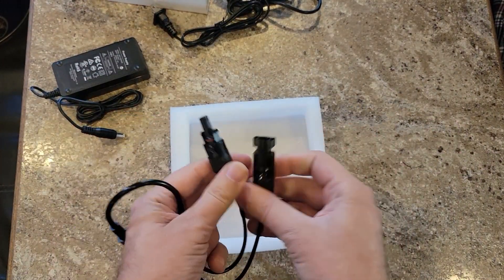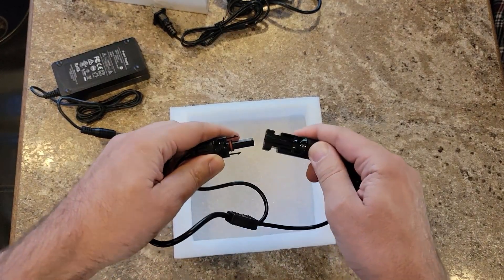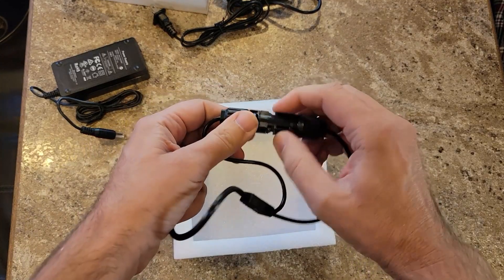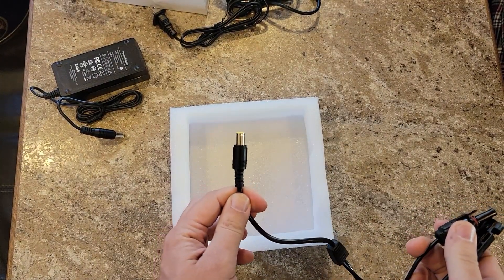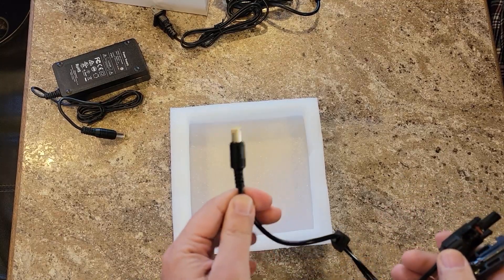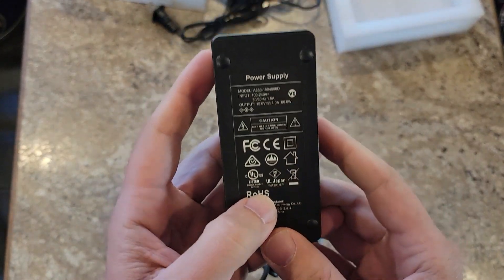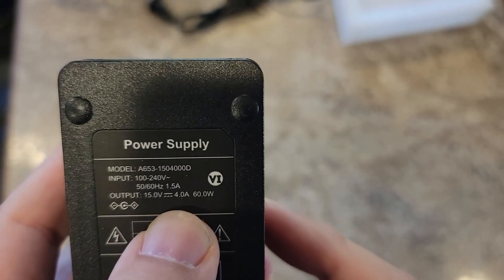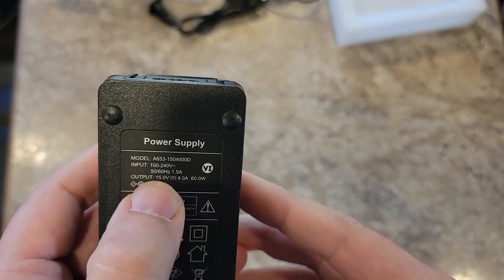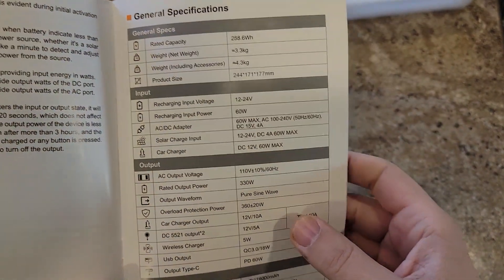You have to be really careful with the MC4 connectors because polarity is not fixed — you can actually plug them into each other. Make sure you get the polarity correct from your solar panel before plugging in; you might need an adapter to change that around, and it may or may not have reverse polarity protection — I need to check the manual. For all of us power nerds: the charger outputs 15 volts, 4 amps, 60 watts — that's a respectable amount for a charger this size. And we are hams, so we can adapt power cords pretty easily.